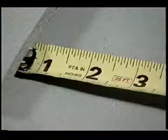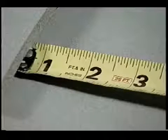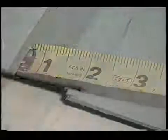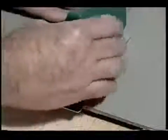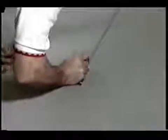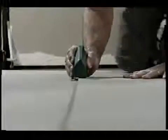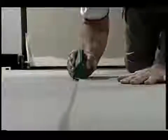Overlap the seams by at least a ½ inch and measure 2 points to make sure the sheets are even before you cut. Once this has been completed, using the seam and strip cutter, begin to cut your seam. The strip cutter will slightly bevel the edge of the cut to allow the bulletin board material to expand slightly to create a tight, firm seam.